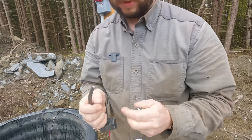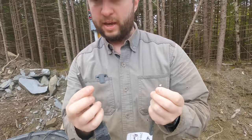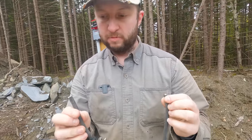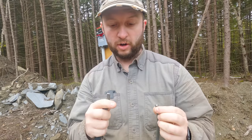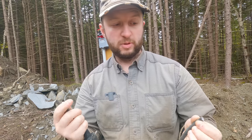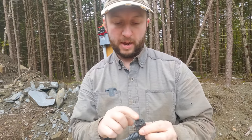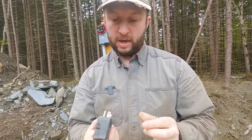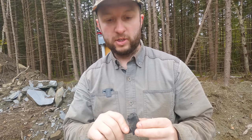Okay. Aha, that's nice and easy. So there is a black wire and a white wire. I assume these are just simply connected to the float switch, and it's just a switch, just toggling on and off, much like a regular light switch would do. And so I'm gonna see if I can get continuity now between the male and female sides of the hot wire here, and see if I can work out which is which.